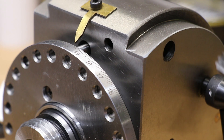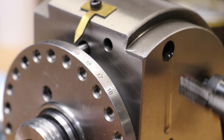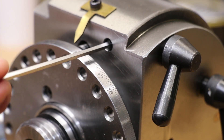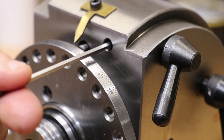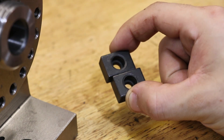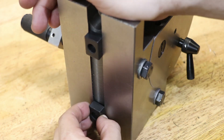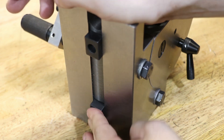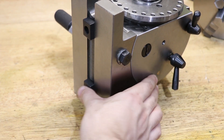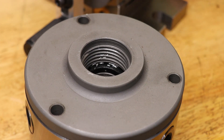While I was at it, I also cleaned out the locking pin pinion — there was a bit of crud in there I wanted to remove. The factory also didn't include a locking grub screw, so I added one to keep the handle in the hole. One thing I got wrong in the previous video: these are keys used to key the head to the mill table. When you remove the head and put it back, these keys fit in the T-slots and the dividing head should remain parallel to the table, as long as you set it up correctly.